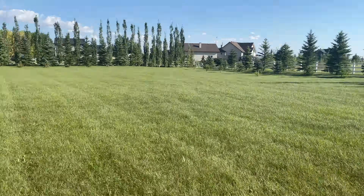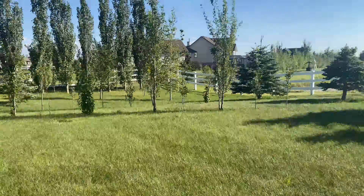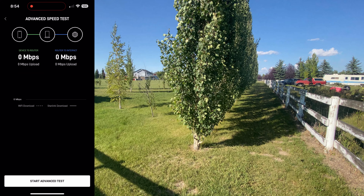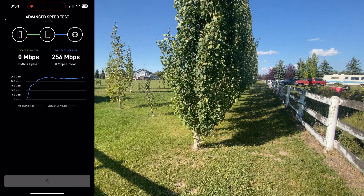Now for range testing. Fast-forwarding to the back corner of my yard, which is about 300 to 340 feet away from the shed. I'm using Starlink and they have their own speed test, but the speed I'm most interested in is between my phone and my network, not the internet. I'll fast-forward through that part of the test — I saw 126 Mbps flash by, which is pretty impressive at this distance, and the upload hit 137 briefly then stabilized at about 27, which isn't too bad.